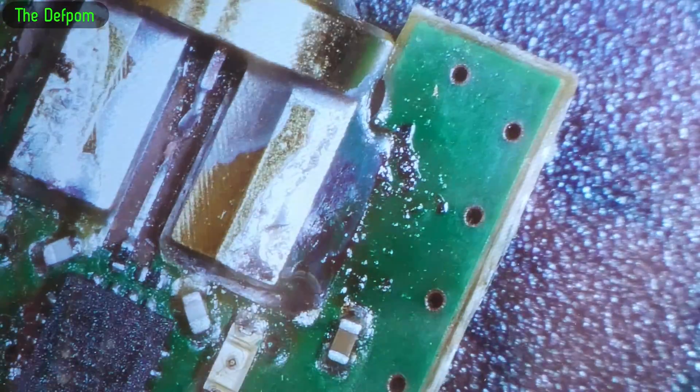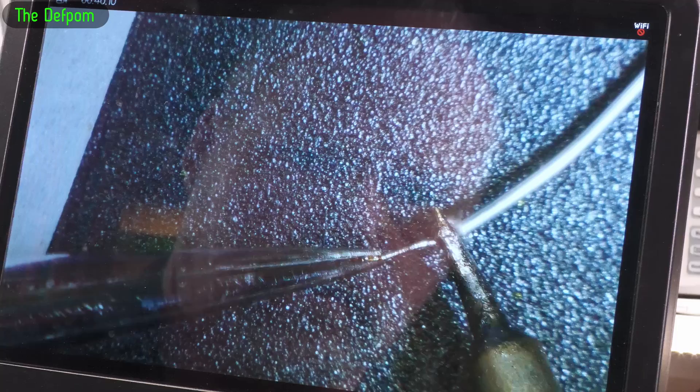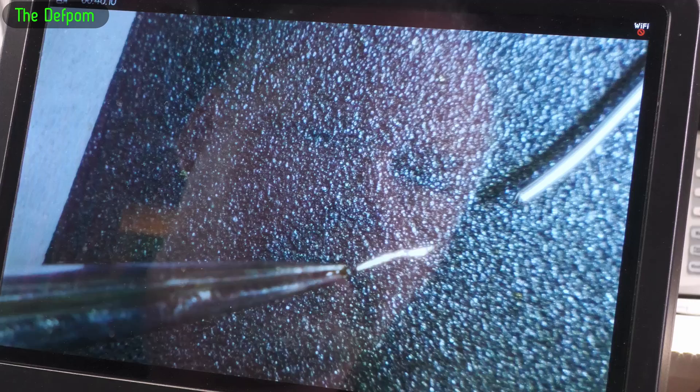Now it's got to fix that centre conductor, which you can clearly see now has a gap. So we have a single strand of wire here and we're ready to go. Let's put some solder on it — I just want to make sure it's all really well covered so it's easier to attach. Not too much — I've done a bridge accidentally but we want enough to make sure it's going to attach. Just a little bit of residue on there.